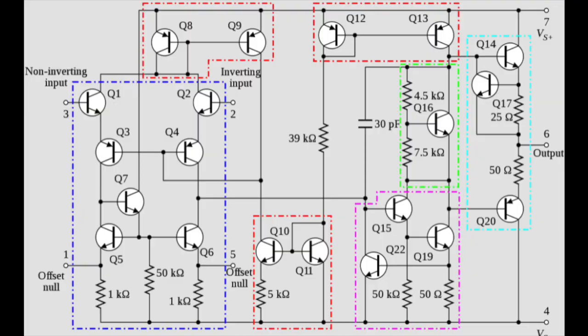In one case, I was teaching a class and some guys came up to me on a break — from Germany or something. They said they had an amplifier, were doing the FFT, and getting all this strange stuff. I checked their numbers and they were coherent. I asked them to show me the circuit and it was an AC coupled amplifier.